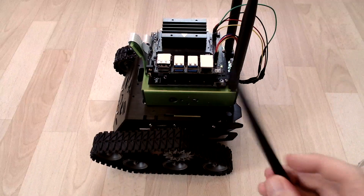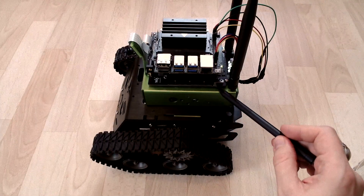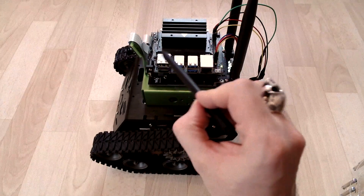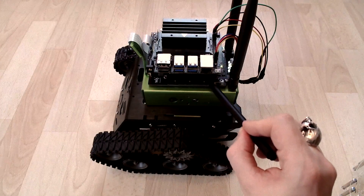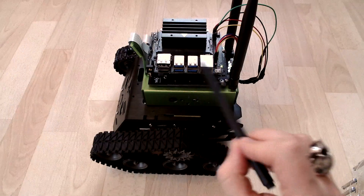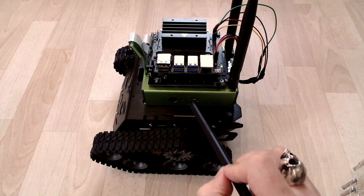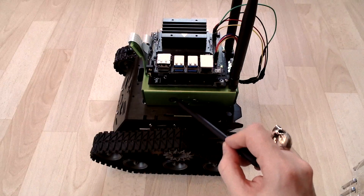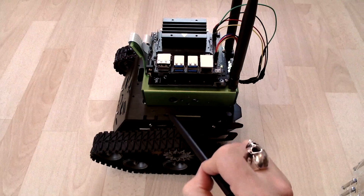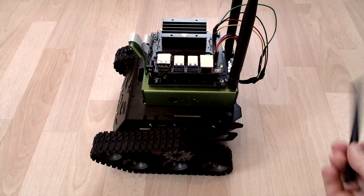What I have added here is this green thing. It's a WaveShare JetBot. The WaveShare JetBot is the chassis here. It has WiFi connectivity and also a very nice wide-angle camera that you connect to the JetBot. What you see here is the motor controller, which also has a couple of placeholders for batteries — so basically this is autonomous. It gives the Jetson energy via the cables and can also power a couple of motors. In this version, I have removed the motors and connected the JetBot directly to the DF Robot Devastator tank, because I want it to go a little bit more outdoors.